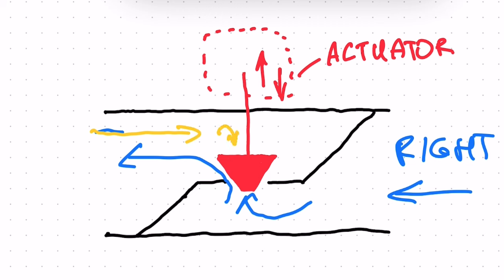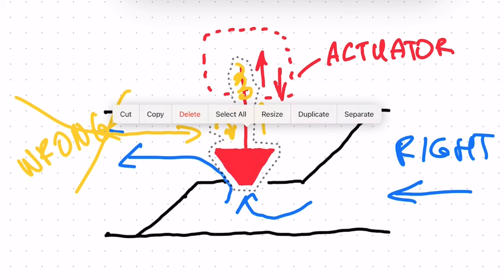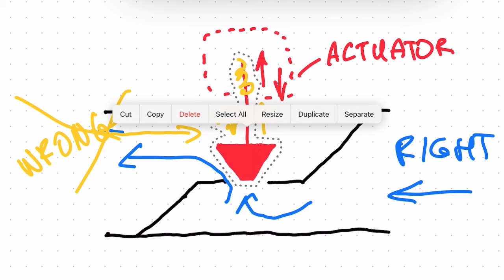If flow goes in the wrong direction — from this part — it pushes the cone from the top and forces the cone to close. But the spring inside the actuator or valve drags the cone upwards, because the actuator does not want to close the valve. This wrong flow direction creates movement of the cone, it starts to vibrate, and that's where the banging, the knocking noise, comes from.